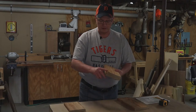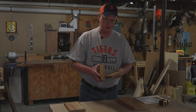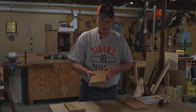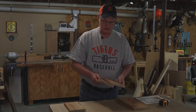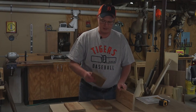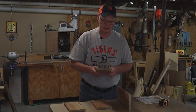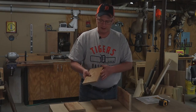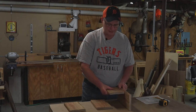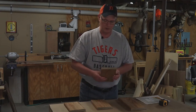And like I mentioned, there's a radius on one of the faces of the particular board that I got from my local home center. And because I want our joints to be nice and square joints, you have to pay attention to the angles that we're going to be cutting on these side pieces. I want a nice flat joint on the outer edge going to my back. So I want the radius on the inside edge of the birdhouse.